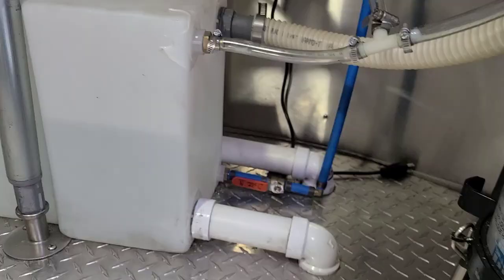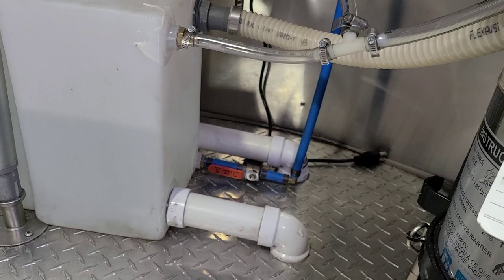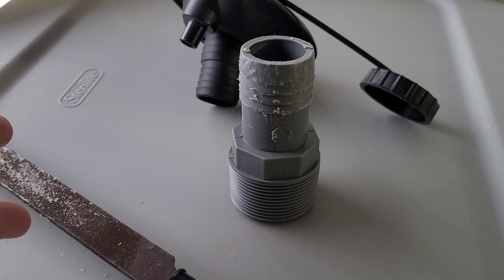Just so you can see how the inside looks — that's how it looks right there. Those are the two drains that go into the two tanks: the fresh water and the waste water. On the fresh water tank there is one more hole that we need to fill — it's an inch and a half, it's on the fresh water tank on the top right, and that's gonna be used to fill your water tank.